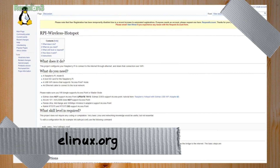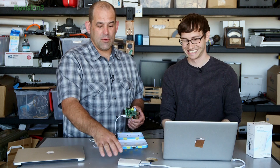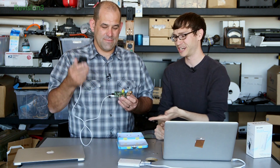Basically, it's a USB Wi-Fi dongle that we bought off Amazon. To get hostapd up and running, there's a nice little article on eLinux. If all this sounds kind of frightening, you can either go with the TP-Link or wait until they actually create a boot image specifically for the Raspberry Pi — that should make it a little bit easier. If you're just looking and don't have any hardware, I would definitely go with the TP-Link version, because it's so easy, it has the built-in battery, you don't need an external battery, and it ends up being cheaper than the Raspberry Pi.